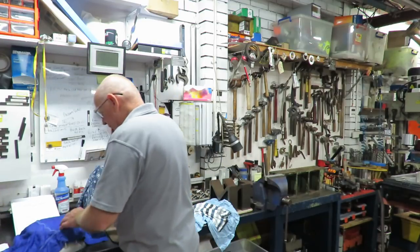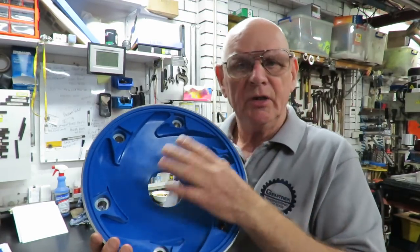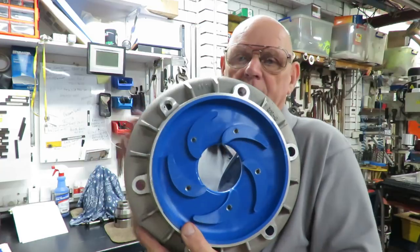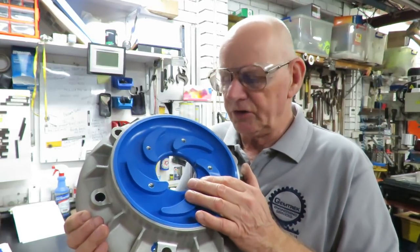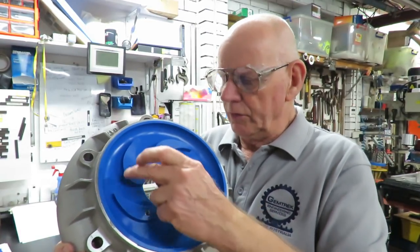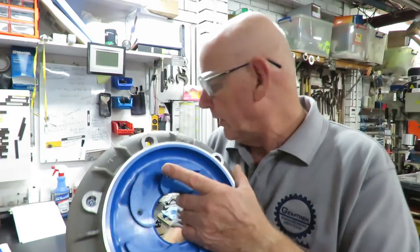The next feature item is this diffuser from a pump. These we have cast, and this is part of engineering works I've been doing over a long period of time. On the other side is a set of screw holes. We've been finding some little anomalies between the parts being manufactured and actually arriving here in Australia. So I have to make up a test jig to check whether the drilled, tapped, and helicoiled holes are within the required dimensions I've laid out — that's a project I'll be working on.